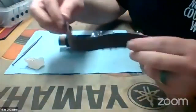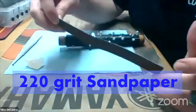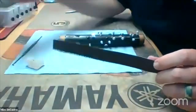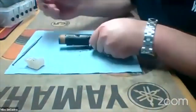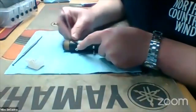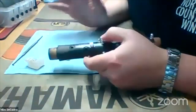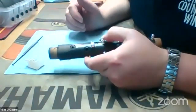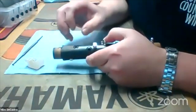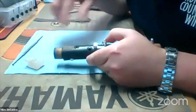I'm going to start out with regular old 220 sandpaper — that's what I have around and what I use on thin corks. I'll start out with 220 and just sand it until it's a fairly smooth surface. After that first pass with sanding, I'm not going to blow that off or anything. I'm going to leave it all right there and add super glue to it, because that dust is really nice and fine and it's going to work into the holes that I drilled as well as the crack itself.